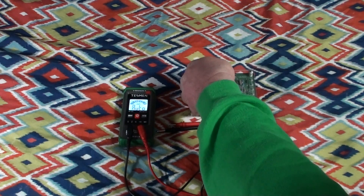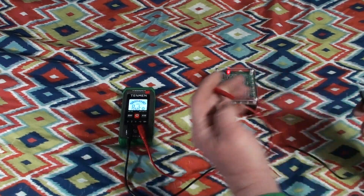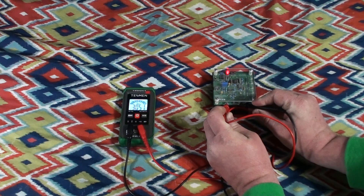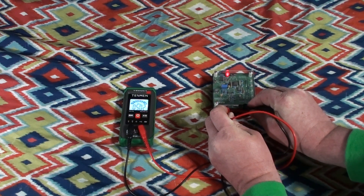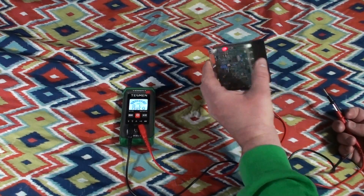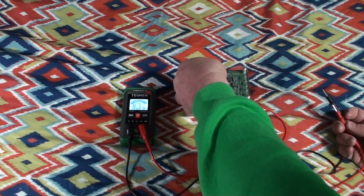The first thing we'll do is make a DC voltage measurement. We'll put our positive probe on the positive stub coming out of the DMM Check circuit board. If I can quit shaking long enough to make a good connection, the meter reports 5.02 DC volts. That's certainly more than close enough to perfect for me, especially since I've owned this for a couple of years and it's undoubtedly no longer considered an exact calibration.